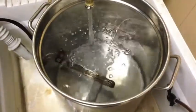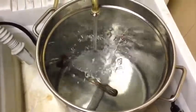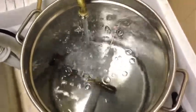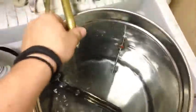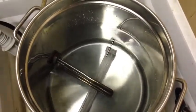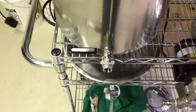I just put it in my laundry room tank here, filling it up with water to see what we've got. I found with some of the fittings that you can't really tighten them down too much — these are all weldless. If you tighten them down too much you have a tendency to compress the rubber gasket, and doing that is not necessarily a good thing because it flares out the gasket and creates a little gap. You just put them in finger-tight and it seals up nicely.